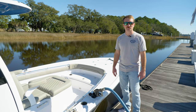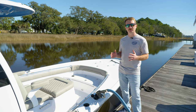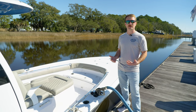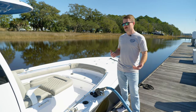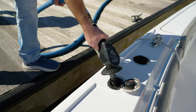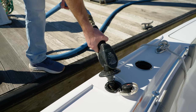Another thing to note is fuel tank ullage. For instance, the 267 has a 116 gallon tank. The ullage is going to be anywhere between 8 to 10 gallons, so you're only going to be able to get 106 to 108 gallons in the tank. You want to be sure you're not overfilling the tank, as doing so might balloon the tank out and put a lot of pressure on the seals and valves throughout the whole tank and fuel system.